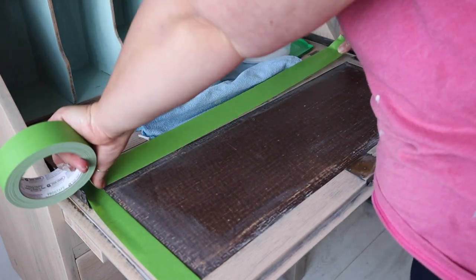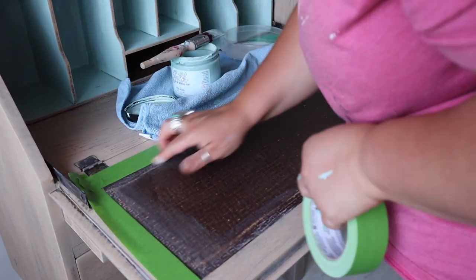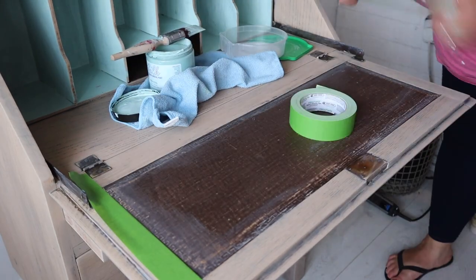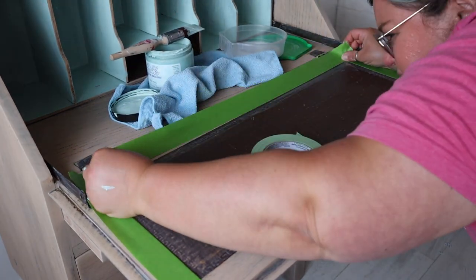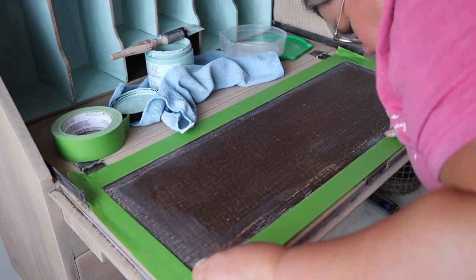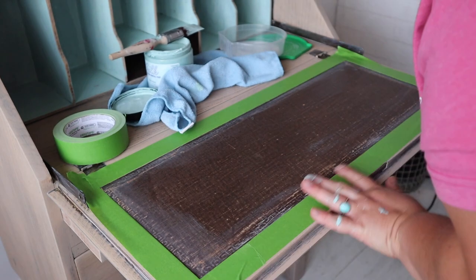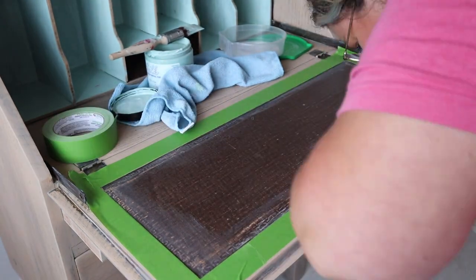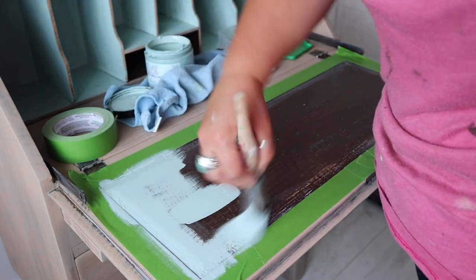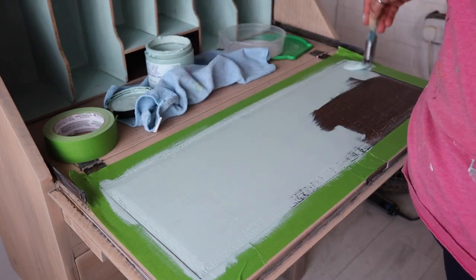While I'm waiting for it to dry — you remember me saying I had plans for the interior cupboards? I'm going to paint them with a pop of colour using Tide Pool in Silk all-in-one mineral paint. I'm using Silk because there are ink stains in those cubby holes and Silk has a built-in stain blocking primer. It also has a built-in top coat, which saves me from having to top coat after painting two coats on each cubby hole. The brush I'm using is a small one-inch flat synthetic brush from Dixie Belle, perfect for getting into all those little corners. I'm also going to use the same colour to refresh the leather pad on the drop-down lid, taping off a nice straight line for crisp edges.